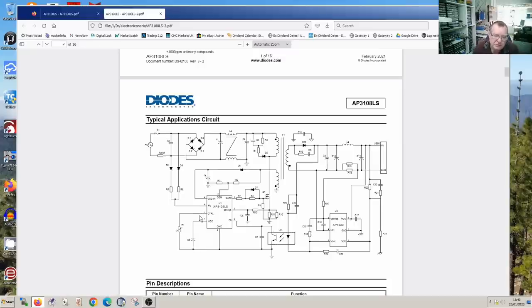It continues to charge this capacitor. If for some reason this circuit doesn't fire up, for example a problem with the MOSFET, a problem with the diode, or a short circuit on the output dragging the power down, this diode can't charge this capacitor, so this VCC in doesn't receive a supply, or it receives a very low voltage supply. And the way this works is that these resistors, or this resistor, can provide enough current to charge this capacitor to get it started.